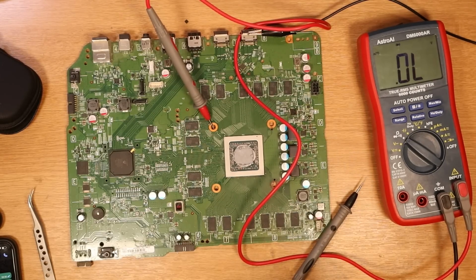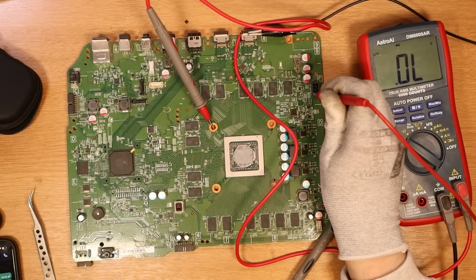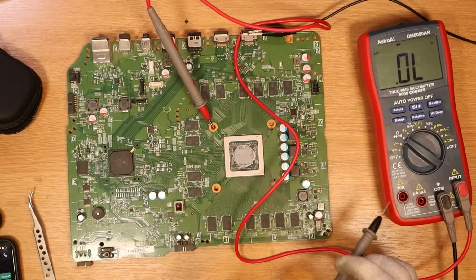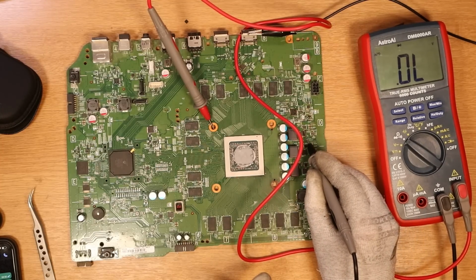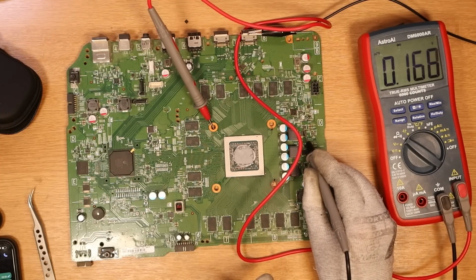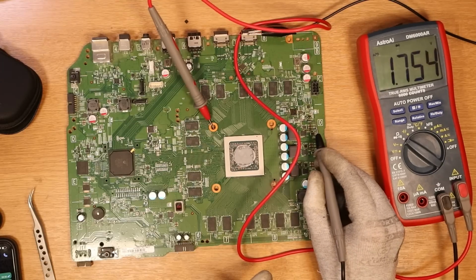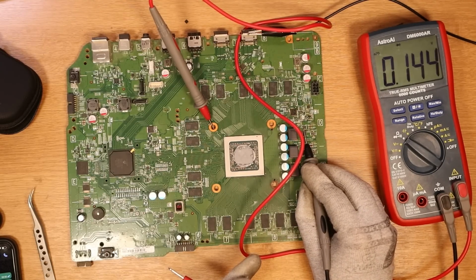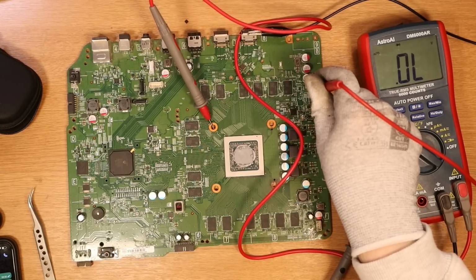I'm going to put it to 10. Let's put 10 volts into the connector, and what happens? 36 milliamps, 35. Okay, I think it's blown. I'm just going to check. 0.1 volts is what's now showing on this one. So what does that mean? Is it partially blown or something? What's going on there? Trying again.